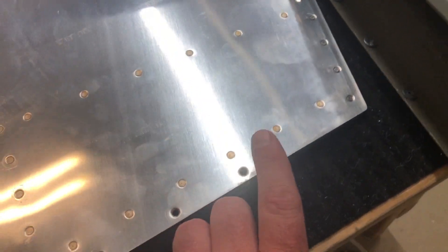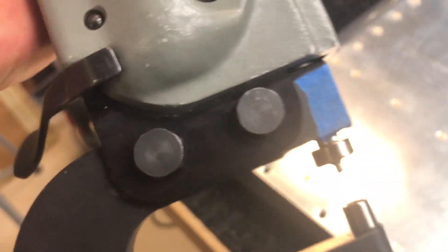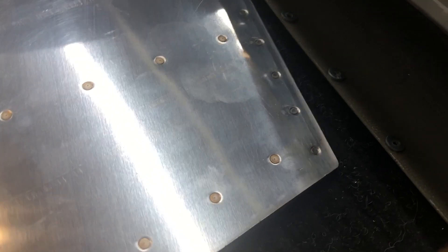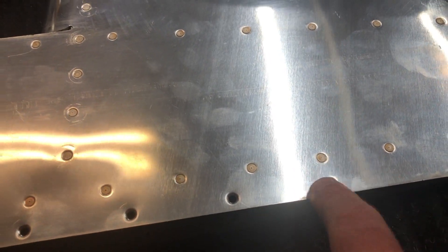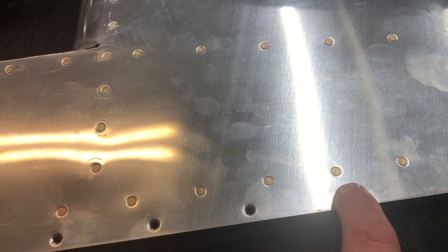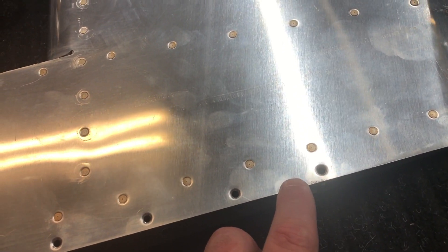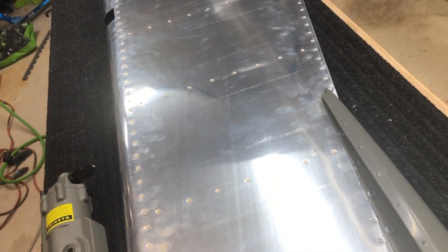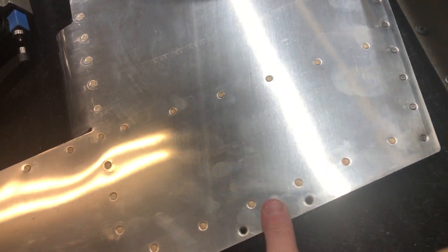You just have to be very careful because the male side of the squeezer — let me show you — the male side has to go in like this. You can see the male side is the side that squeezes out, so if you're not very careful, the male side is going to push down into the hole. You've got to slowly pull the trigger and make sure it lines up, because punching a hole in here wouldn't be the worst thing in the world — you could fill it with a rivet — but when my rudder is done, the last thing I want to do is punch a hole in the skin on the last step.